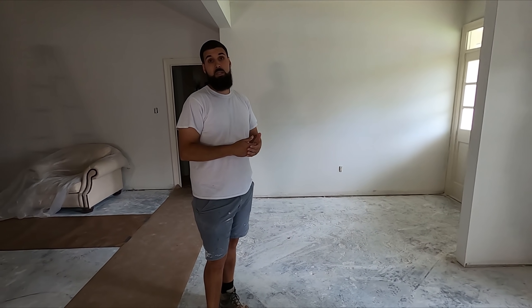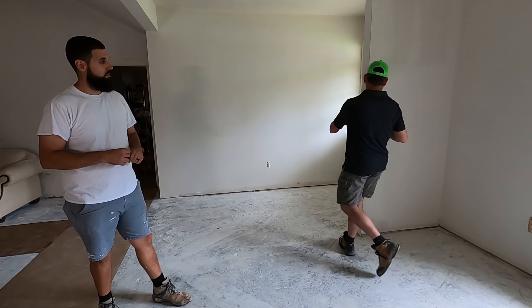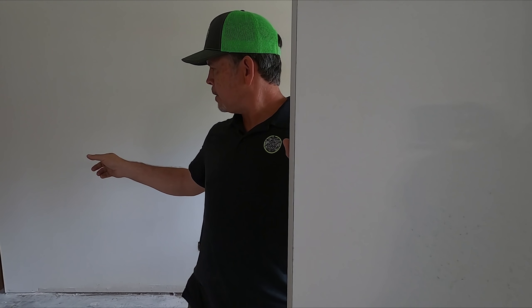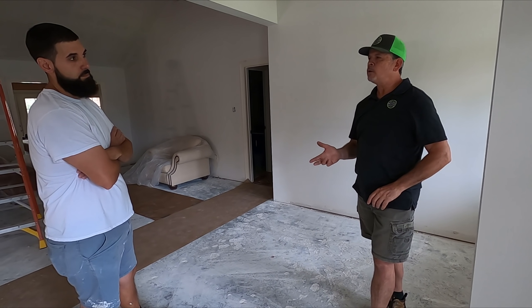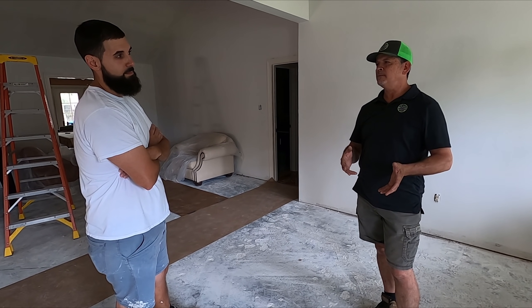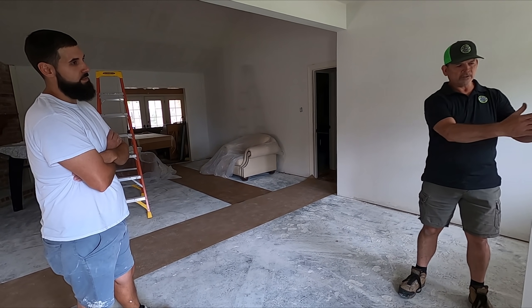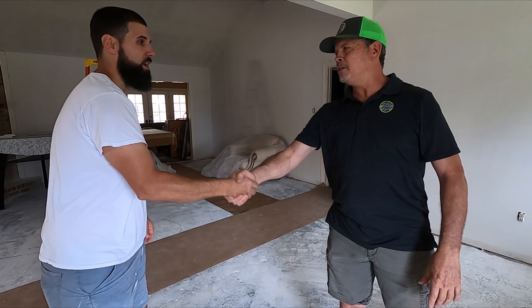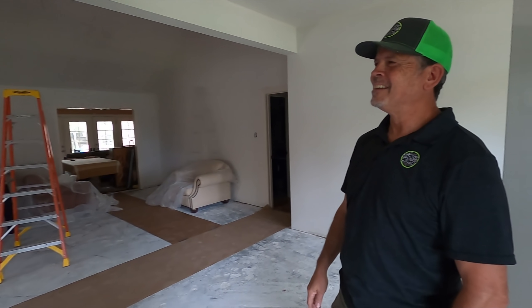Including the texture we sprayed, we probably used about 14 to 15 boxes. I figured six. No, indeed — 14 boxes. Now we talked about these walls and how important it is to get them square. This one was out and that one was out, and I used your shingle trick under the drywall to make sure this was square. On the west coast you can get cardboard drywall shims anywhere, but nobody here seems to have heard of them. So the shingle trick — we just pick up some shingles; they're always laying around on the job, especially new construction — and use a few shingles. Found a couple out back and they work great. So this is nice and square, and when we run our base and crown, everything is square and much easier to do.